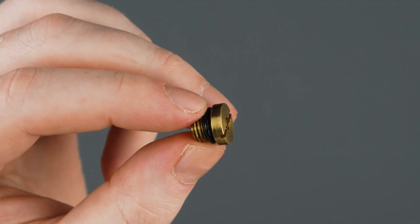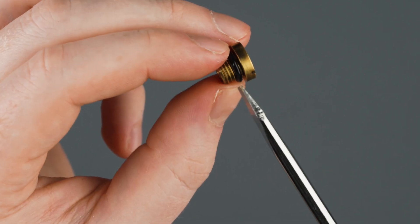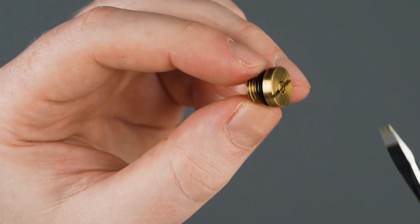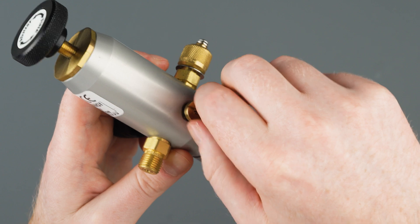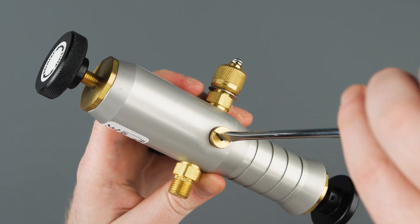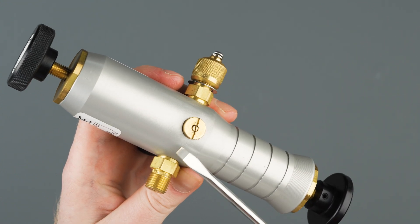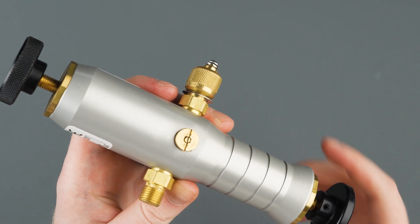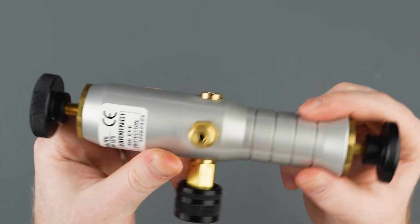Also, visually inspect the O-ring to make sure there's no dust or debris. It's also a good idea to apply some light lubricant to these O-ring seals before reinstalling the check valve back into the pump body. With our new check valve, simply thread this into place just tight enough so the O-ring seal engages. Do not thread this very tight, because if we over-tighten it, we can sever the O-ring seal and the check valve could be leaking. That is how we inspect and replace the external check valve.